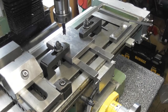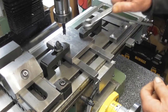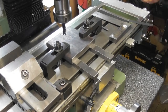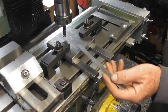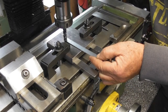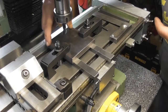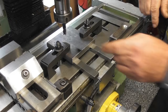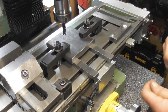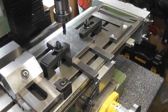So, right, set up square. I don't recall if I've tightened the clamps. They're tight, but not proper tight. Okay, so basically, just set my milling cutter. This is a roughing operation, 63mm from this edge. So I'm just going to chop off this piece on here, then flip it 90 degrees and chop it again. And that'll give me a 63mm square piece, so I haven't got so much material to remove.